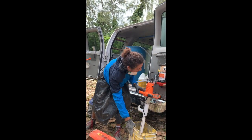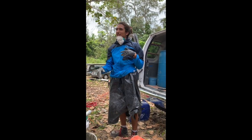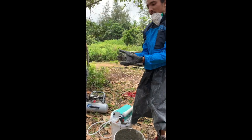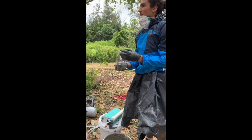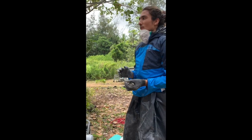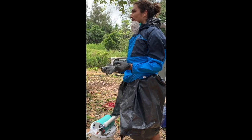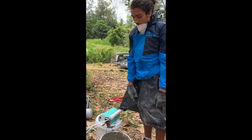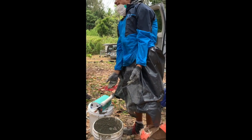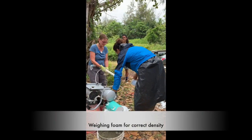If you fill your water cups all the way to the top it might end up a little too lumpy or too pasty. This is the perfect consistency — when we make our mortar it's not going to be running, because if you have running mortar we're sliding it up walls and on the sides of bricks and it all just drips off. If you follow the recipe and it doesn't look right, add more water or more cement depending on the consistency.